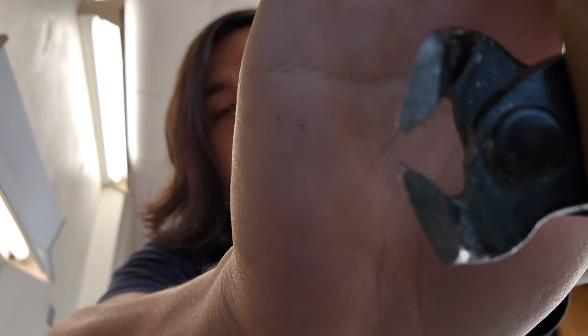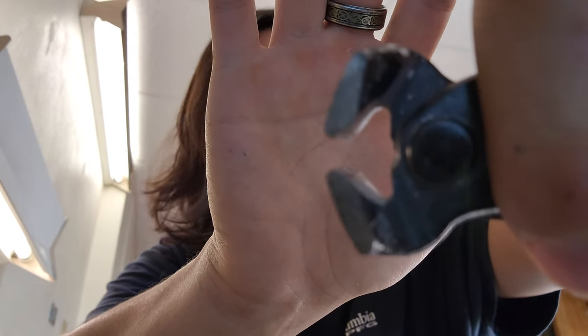These have the Channel Lock design they've been doing on some of their other pliers where the cutters, rather than being two blades, it's got a blade and a chisel. The top jaw has the blade and the bottom one has the chisel — the anvil. The bottom blade is dull, the top blade is sharp, and that actually does in my experience provide an easier, better cut.